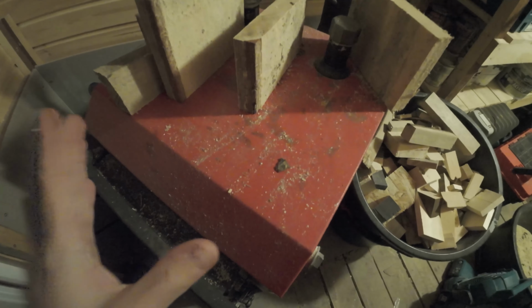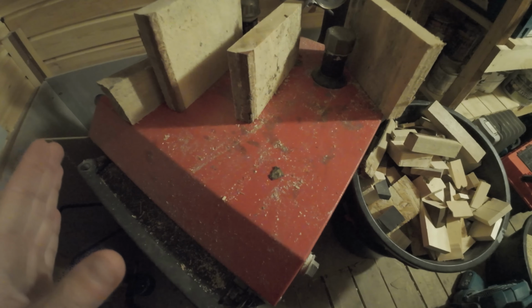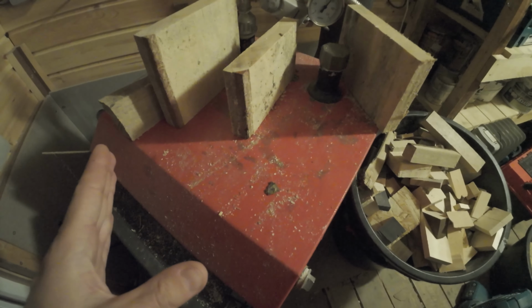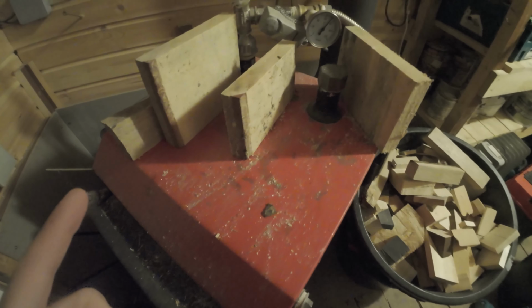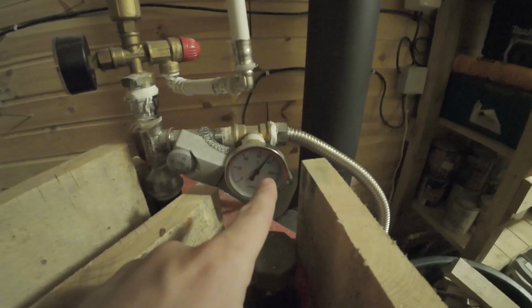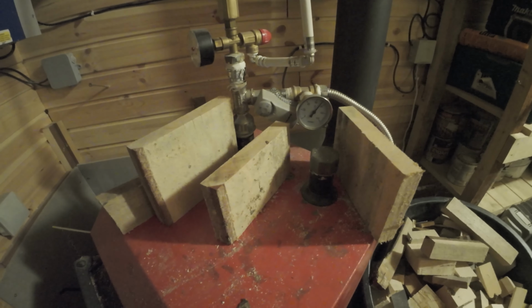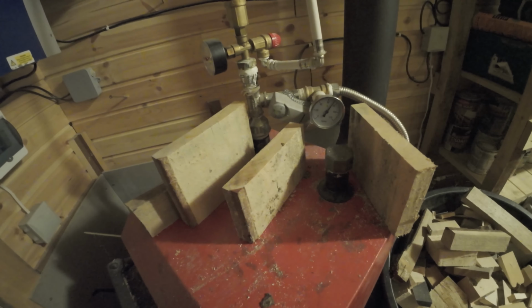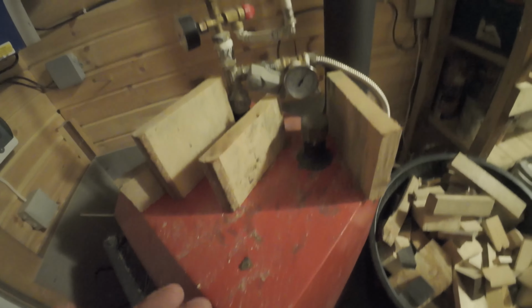In my case, this is a 12 kilowatt stove. It's really difficult for it to actually boil the 1,000 liters. In fact, it's really difficult to get even beyond 80 degrees, and I don't do that. It's even limited here to 90 degrees. So there is actually no point of getting more than 80 or 70 degrees, because you will spend lots of wood trying to reach that temperature.